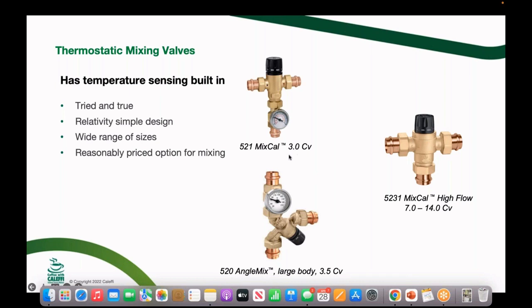In a perfect hydronic world, you select a valve with a Cv that matches your flow rate — Cv is the flow rate through the valve at one pound per square inch pressure drop. If your job needs 3 GPM, buy a 3 Cv valve for accurate temperature control and good valve authority across the full flow range. We don't make every Cv value, so at some point you have to interpolate — should you go to a larger valve or find a 3.5 Cv? The limitation of a thermostatic mixing valve is how much flow you can get through it.